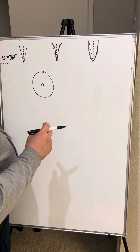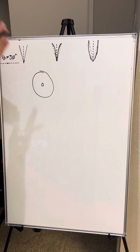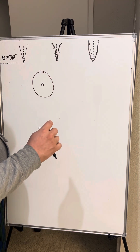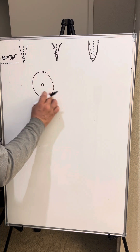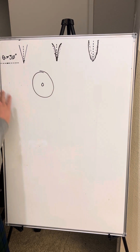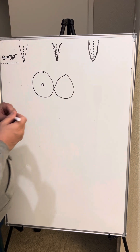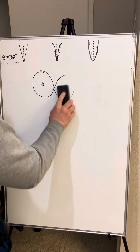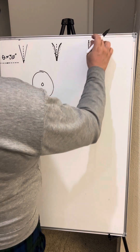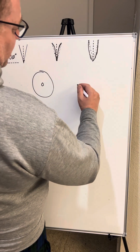If you grind on the outside of the torus or donut — the flat side, laid flat like a pottery wheel — you get a flat surface to grind on. That's where you get your bench stones and that sort of thing today. Two flat surfaces come together into one point, which is why you can get an incredibly narrow and sharp edge. The convex grind is usually what you see with a belt setup — the belt travels through, has flex, and grinds a curve.